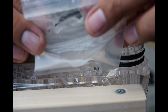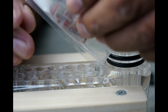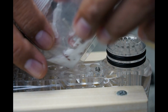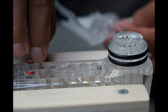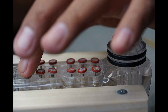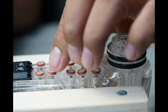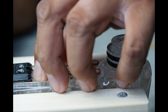Now your bar gun kit comes with a small package of baking soda. Place the top hats and springs with the O-rings assembled in the baking soda and just agitate it for a few seconds. We'll go ahead and reverse the process, depressing the top hat and the O-ring and the spring in its socket, and gently slide the bottom plate across.